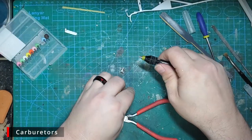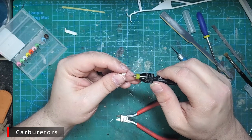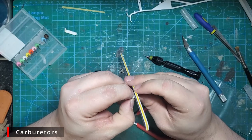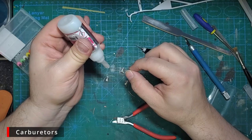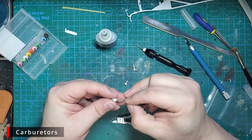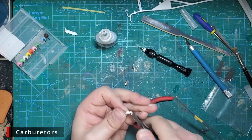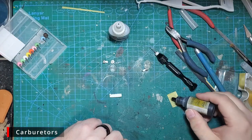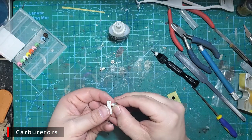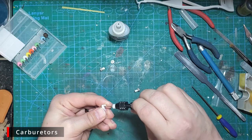We're going to drill the pilot holes with a 0.7 millimeter drill bit. Then I'm going to glue in some number 500 K&S piano wire — you can use any wire — we just want to make a pin so it seats firmly when we mount the carbs to the intake manifold. Cut the pins really close, leaving just enough to act as a pin. Then I dip the metal pin into a little bit of black paint and tap it on the intake manifold where I want it — that's my mark for where I need to drill.